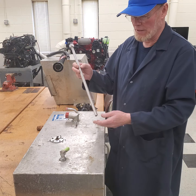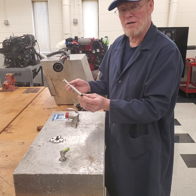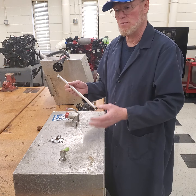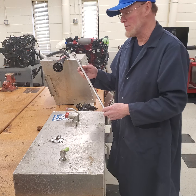At the bottom of the pickup, the bottom could have a screen on it which is called a rock screen. That is in the ABYC standards. A lot of times you won't see that on gasoline engines because of your fuel water separator. On diesel engines you may see it.